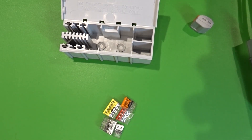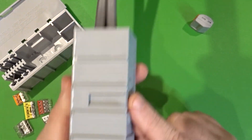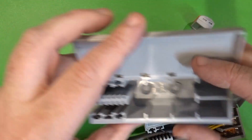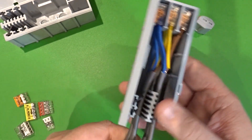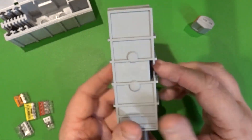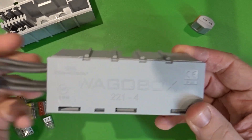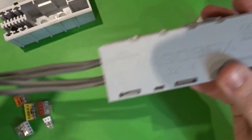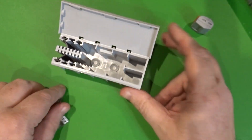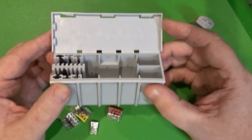Don't forget there's also the fixing/mounting button. I spoke to ConnectBox at the most recent electrical exhibition — the main concern is they don't package the mounting button or these inserts with the ConnectBoxes, because most likely we may not need them and there would be excessive plastic wastage — that's an ethical decision. Some suppliers are throwing in the button with the WAGO box as part of a deal. If you're going to install the newer devices in the older or XL WAGO boxes, you'll need to consider getting these inserts to achieve maintenance-free compliance.